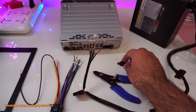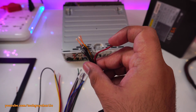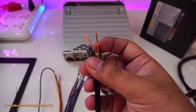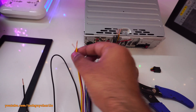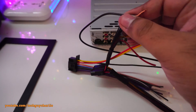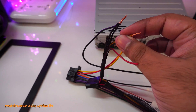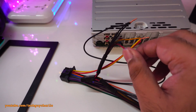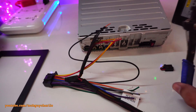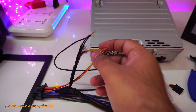Take your wire stripper and cut out a floppy disk connector or any connector you won't use. We don't need the red wire from the PSU — what we need are the yellow and the black wires. Black is ground and yellow is plus 12 volts. Join the yellow and red wires from the harness to the yellow wire of the power supply, and black goes to black. Cut off the red wire of the power supply so you don't make mistakes, and tape up all connections so they don't short out.